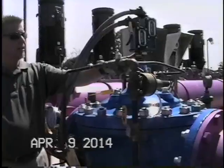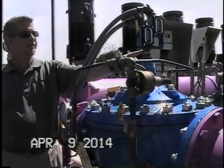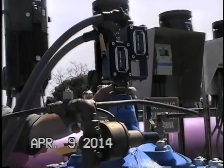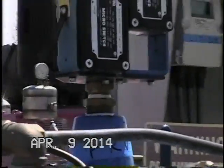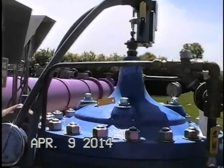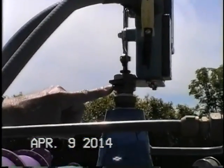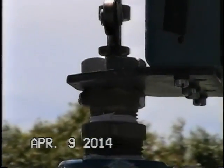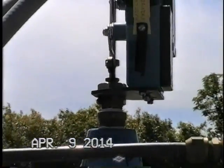The air bleed on this particular valve is this round head machine screw. It's located on the hex of the adapter here, over on this side. And again, every time the valve is serviced or water is bled out, here's our adjustment right here, we want to make sure that we open that up, make sure that we get water coming out, and make sure that all the air is bled out of the cover chamber.